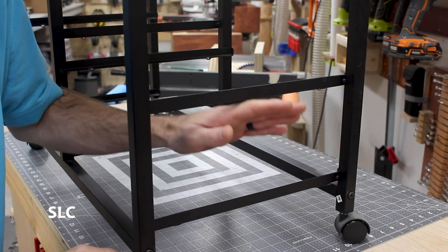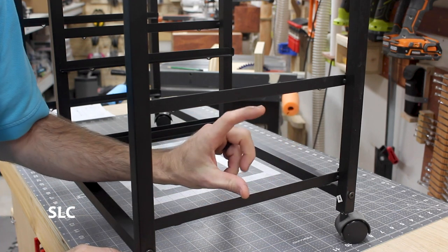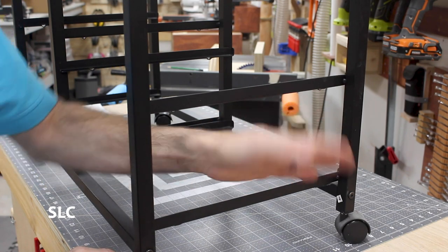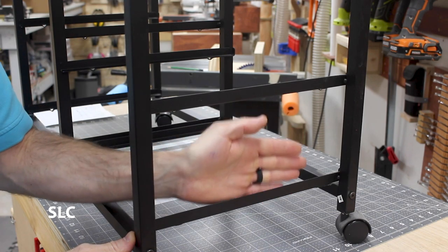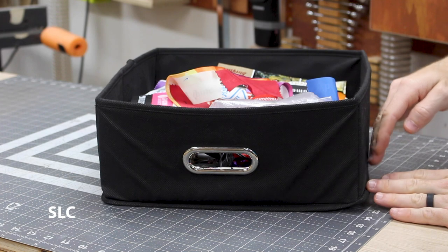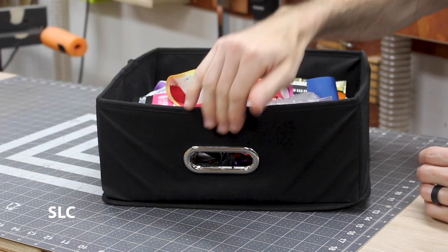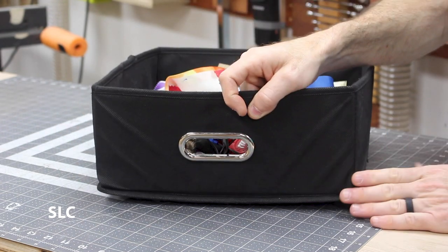Another thing to take into consideration is that these have open sides. If this was a closed-off wall you wouldn't have to worry about having the drawers the full height, but since it's open, things can easily fall to the side or get stuck when trying to pull them out — that's why we have to make them really tall. Also consider when building your drawers that you need to know exactly how much room you need for the slides, whether they're going to be on the bottom, on the sides, or wherever. Fortunately my cabinet already has some built in so I'm not worried about that.